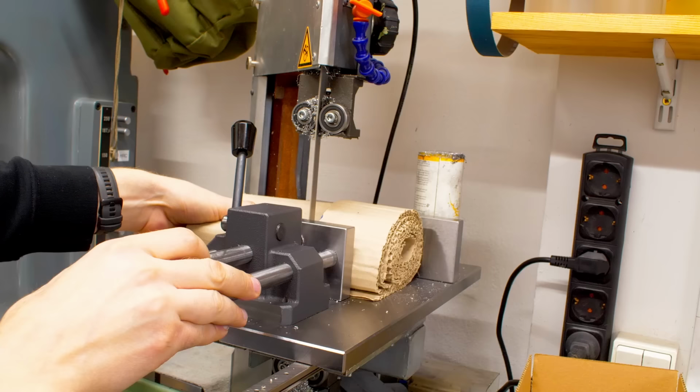These are done, in this case, since it's a straight through coolant hole, on an EDM drill. That's like a ram EDM for sinking contours into, for example, mold parts, but a hole popper or an EDM drill is radically faster, with a lot of increased electrode wear, at least a 1-to-1 ratio of electrode wear to drill depth, but it's fast.